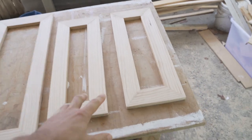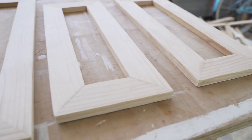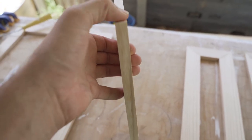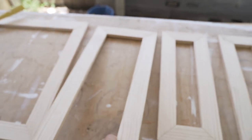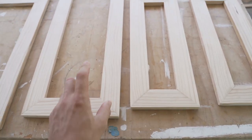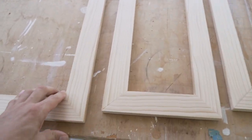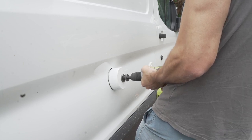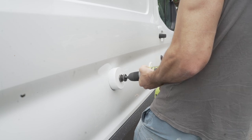Here are all the fronts for the drawers for the kitchen. I've stripped down some two by fours into 15 millimeter wide, 40 millimeter thick pieces, and now I'm going to undercoat and paint them before I install the kitchen unit. I'm also going to create some ventilation holes for the fridge and the oven.